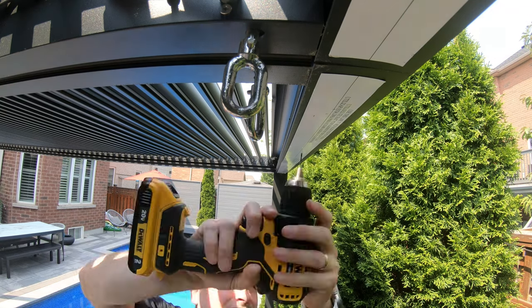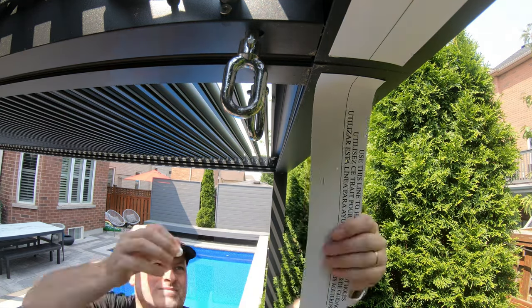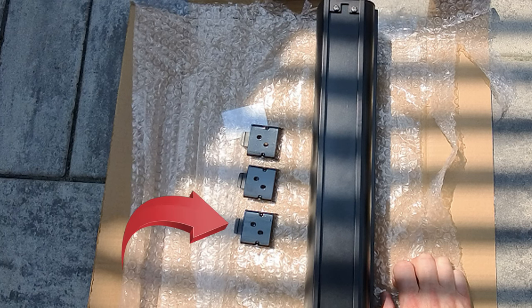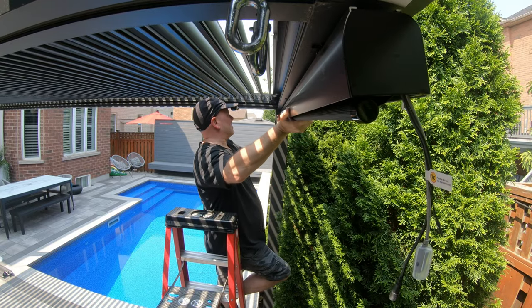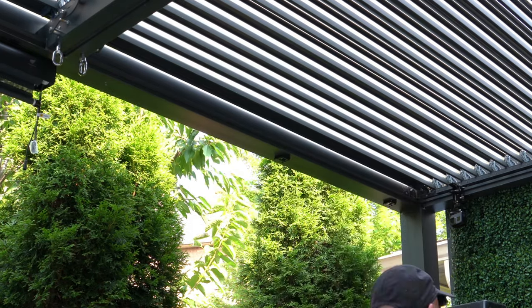Because my pergola is aluminum, I needed to pre-drill some holes for the screws. I went with the smallest drill bit I had and ended up breaking a couple in the process — but that was my fault, not the blinds. Once I got all the holes drilled, it was really easy to put two screws into each bracket and secure them to the pergola. Each bracket has a little spring-loaded release tab — this is how you'll remove the roller shade in the future if you ever need to. When installing, you hook the back side of the brackets into the track on the blind, then push the front up until you hear a click, indicating the release button is locked into position. To remove it, just push that little release tab and the brackets let go.